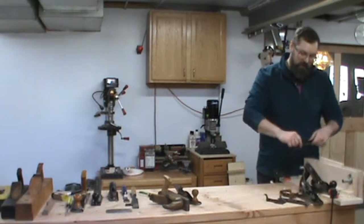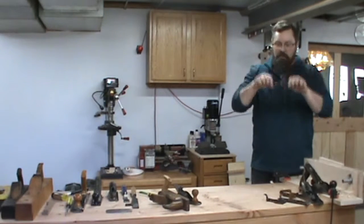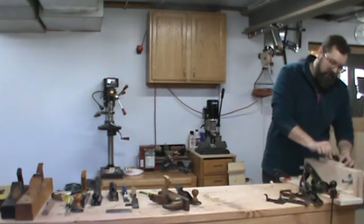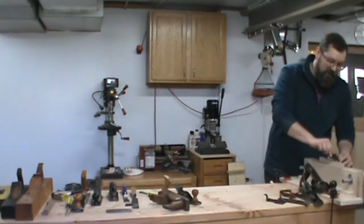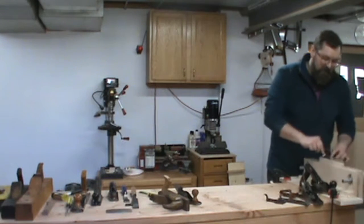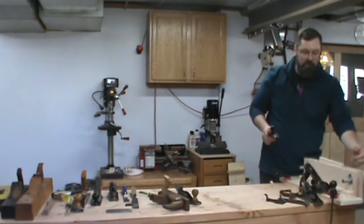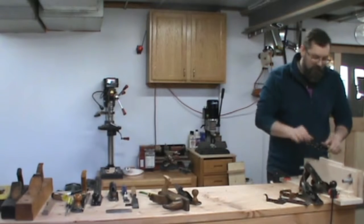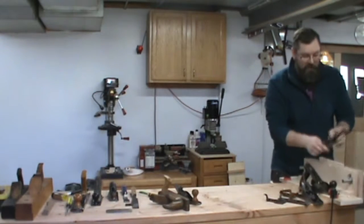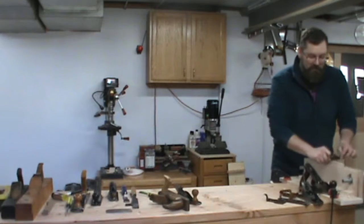If you are cutting a flat surface, you really want to have this iron coming out evenly — the same depth on both sides. But I've got this one set so it's a deeper cut on one side, so that I can take a deeper cut, or if I want a lighter cut, all I have to do is physically move to the other side. So you don't have to stop and adjust it. Here the wood grain is going from my left to my right as it goes back, so even though it cuts great going one way, it tears out when I go the other direction — you can hear the difference. So I can turn this around and just pull it towards me.